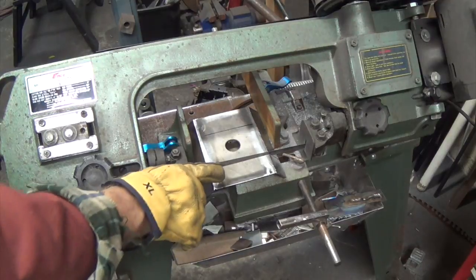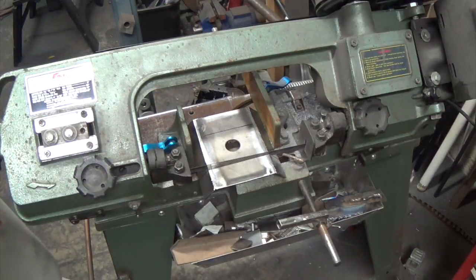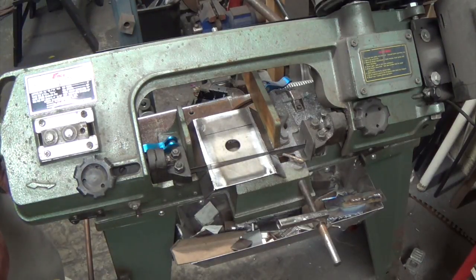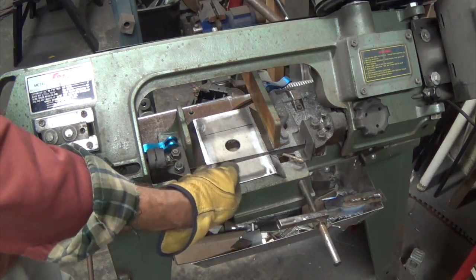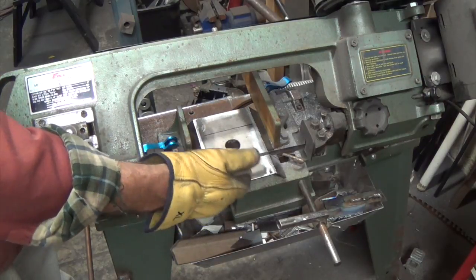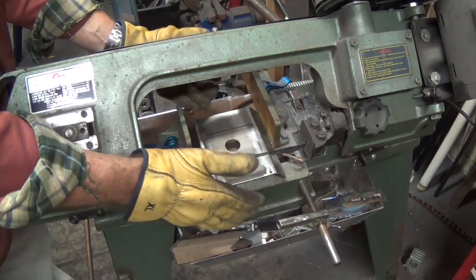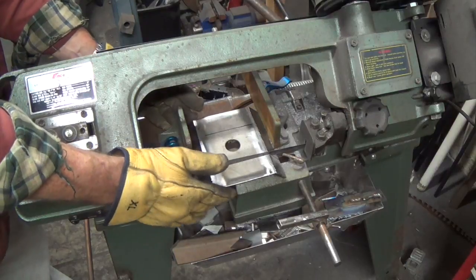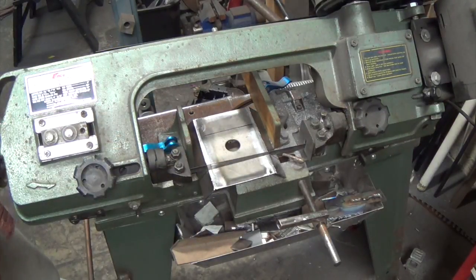Sorry, the plan is to separate these 2 ends. This is fixed, obviously, because that's where the handle goes through. I did a lot of looking and found some blueprints online, and it looked like the beginning of this slot was about 1/4 of the length of this box. So if the hammer was larger, then this was larger. About 1.5 inches is about 1/4 of a 6-inch box, so that's what I made it.